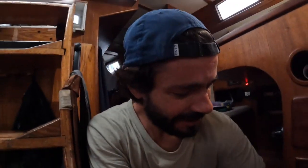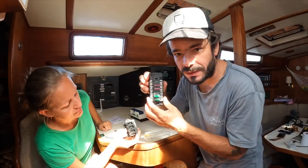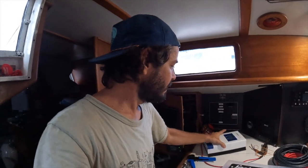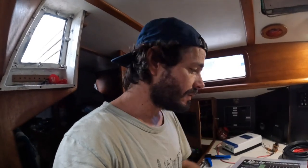Good morning. Now that I basically have all the new connectors for the new fuse holder — if you're new here, last week we replaced the old fuse box for this new one where wires are connected using screws. Everything is ready; I just need to install it in place, connect the wires, and install the fuses. But first I'm going to cut and prepare the new wires for the new solar panels, because I want to install the solar panel controller while waiting for the new panels arriving at the beginning of the week.